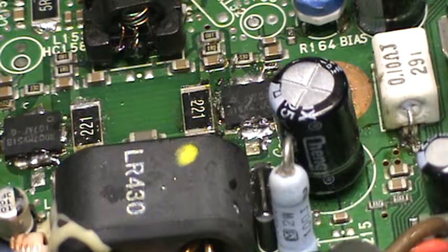Of course, disassembly is just backwards of what that was. Once you heat the hot plate up underneath, once it gets to temperature, they will pick right off of there if your tools get up to temperature. As soon as you touch the chip with a tool, expect it to cool and, of course, stick back to the work.